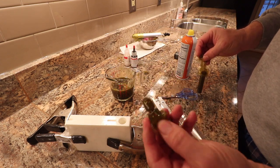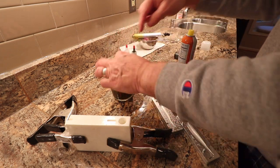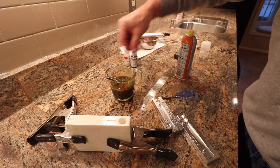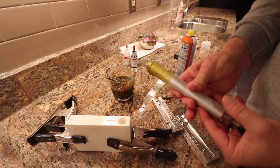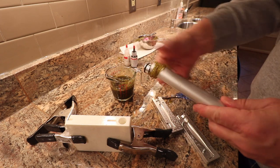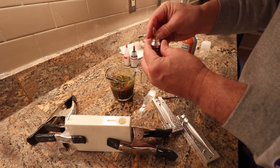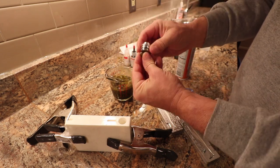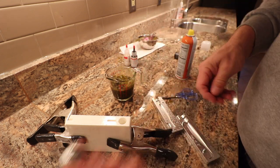All these little pieces you pull out — this is called the sprue — that's the fat part that leads to pouring the bait. You can stick it back in your cup, recycle all that. Ooh, that was hot! Then stick it back in the microwave and heat it back up. Here's the plunger — you can clean this out easily just by rolling the stuff off the shaft, and then you can pull the little button right out. Everything's whistle clean.